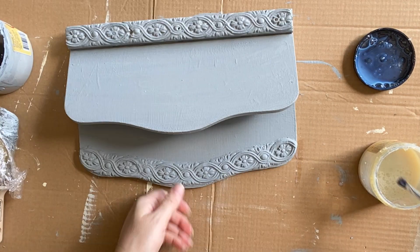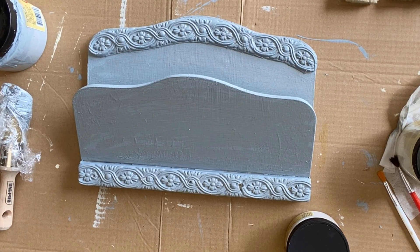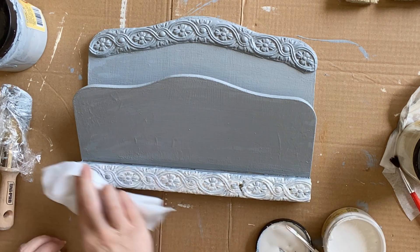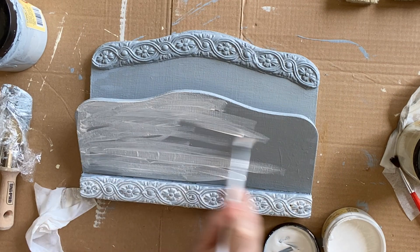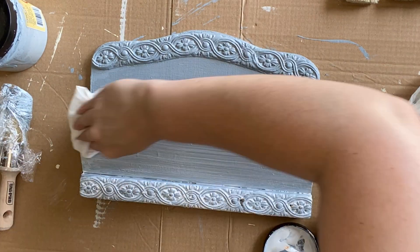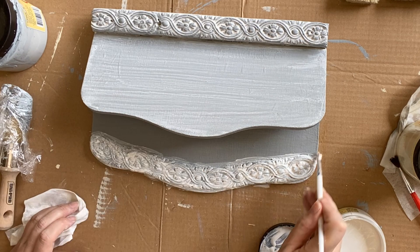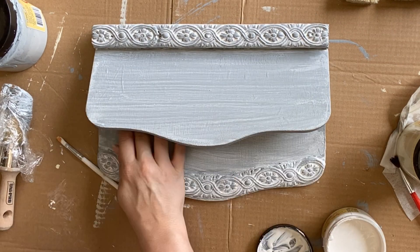The gloss clear coat creates a great surface for our next step — adding white glaze. I'm adding Dixie Belle's Whitewash Glaze to the organiser, paying particular attention to the lovely details of the trim, then using a wet wipe to wipe back the excess glaze. You can see how beautifully it sits in the details. Remember, if you're going to add glaze to anything, it's a good idea to put down a base coat of sealer first — the Gloss Clear Coat gives me the freedom to wipe back as much or as little as I want.